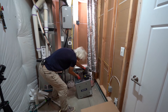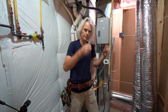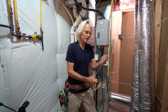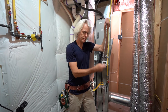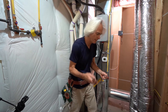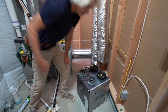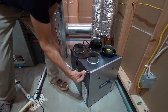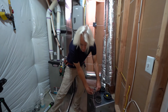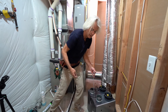The unit will orient up into that space. Brohn has taken a lot of contractor feedback on installation design. There's a pre-installed chain system — we install the chain to the ceiling — and it includes an isolation spring for vibration. Rather than screwing something to the box, there are little tabs on the side: just take a putty knife, slightly bend the tab out, then wiggle the chain loop in. That's the hanging point. Take up the slack and install the spring so vibration isn't transferred to the floor. It's designed to be quick and easy.